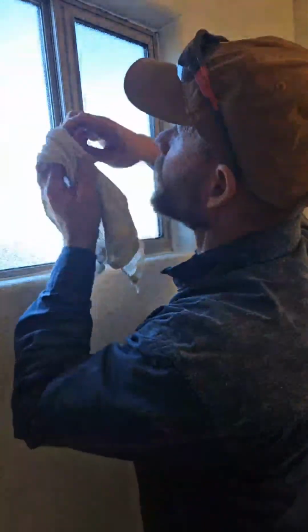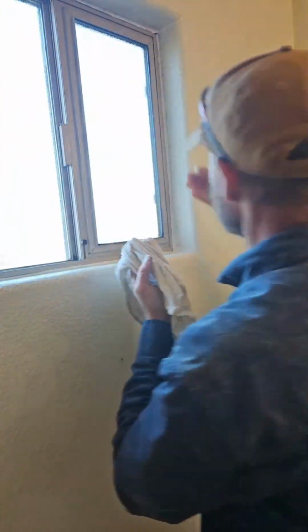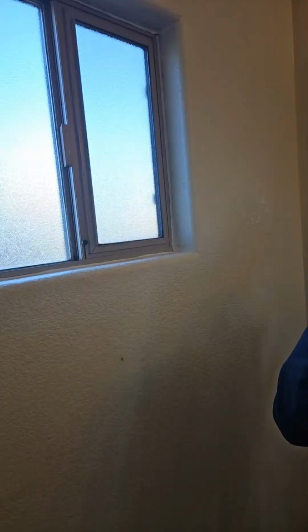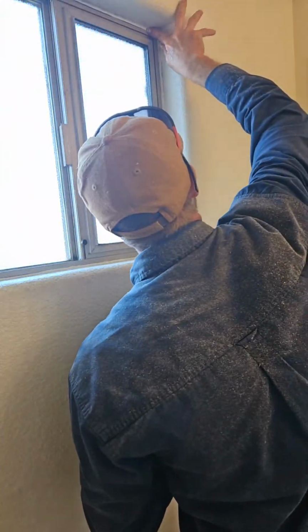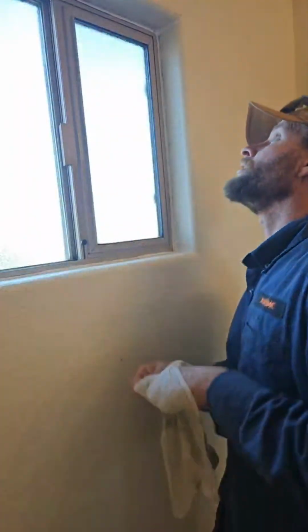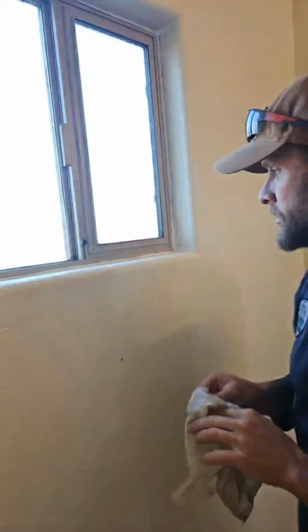All right, get my finger really wet. Spread that out. That's the trick of getting your finger not so dirty and getting a smoother spread. Have the finger really wet when you stick it in there. Helps with lubrication so it slides across the top. We're talking about caulking here. So if you don't like that, get out of here.